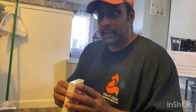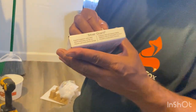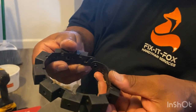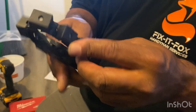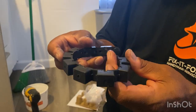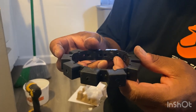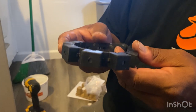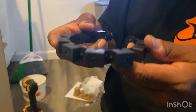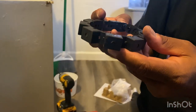There's one last step with these American Standard disposals — this silver guard that comes in the box. It's a magnetic collar that you put around the top of the disposal. It's magnetized, and if anything metal falls through the sink, it'll stick near the top of the drain and won't actually fall into the disposal. So it's kind of a valuable tool. Not all that necessary, but because it comes with it, we'll put it on. The hardest part is trying to get this button to snap together.